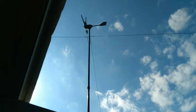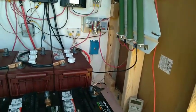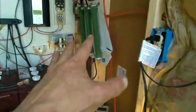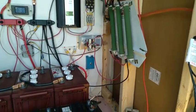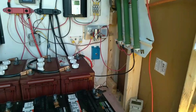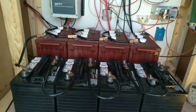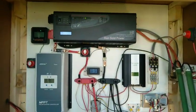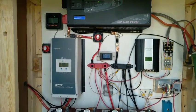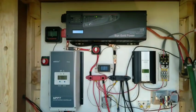It's a 600-watt turbine, and when the wind is whipping up here she chucks power. The resistor load will be able to dip out the full potential of the turbine — usually you rate your diversion load for two-thirds of it, but this system basically sits idle and will continue to sit idle until some lumber is ordered and construction begins. At that point it'll be under rigorous use and the inverter will be able to take it.